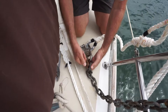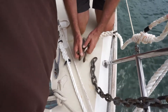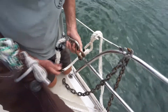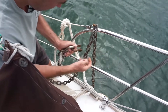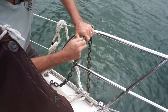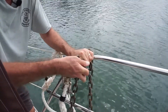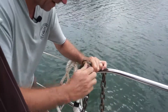You do not need to take off the pennant or the swivel. Just loosen the shackle. Now move the shackle to the position on the chain that you want for the proper depth. In this case, we'll move it here for demonstration. You'll need to pull the link to put the pin through the end of the link.